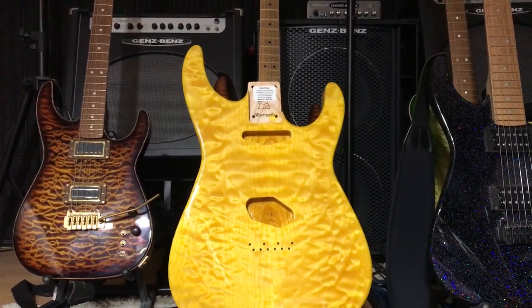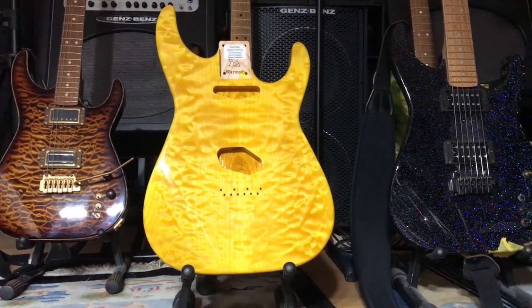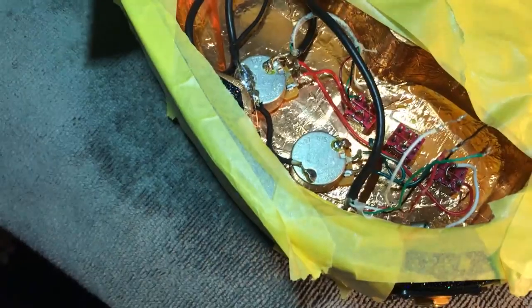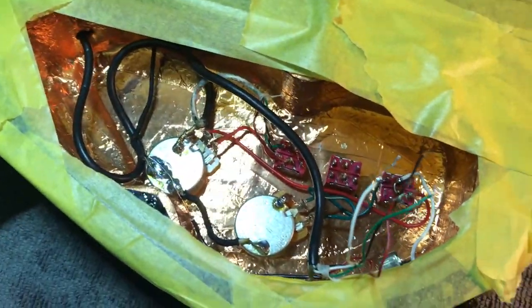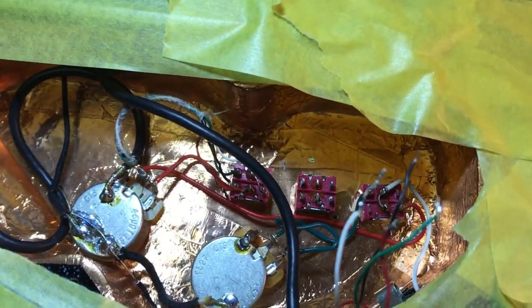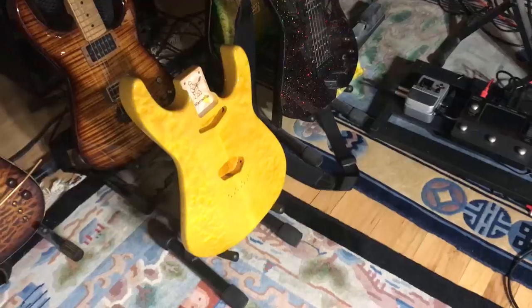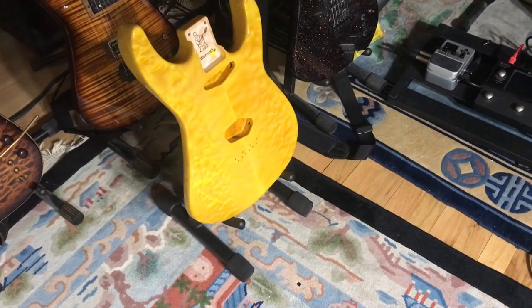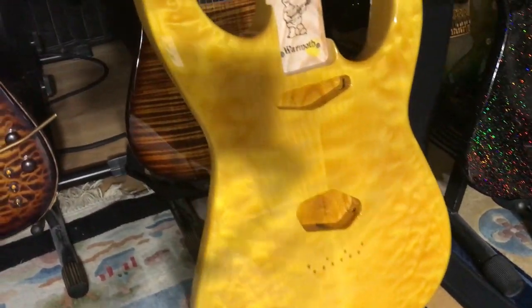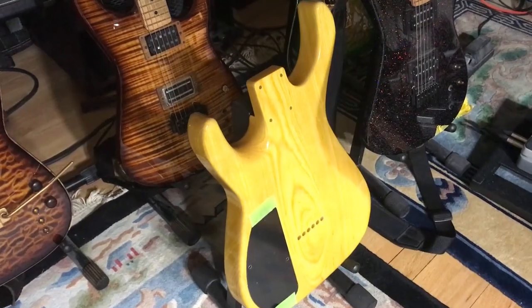While waiting for delivery on my hybrid Soloist, I experimented with different wiring configurations on my other Soloists with the humbuckers. I always use low-tech yellow frog tape to protect the body and neck anytime I'm messing around with it, but the net result was I prefer series when there are two humbuckers versus parallel. Series combines the two humbuckers; parallel keeps them independent, but there is an option where you can get a push-pull pot to switch between parallel and series, which I might do in the future.